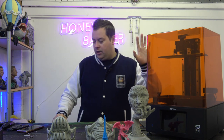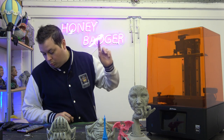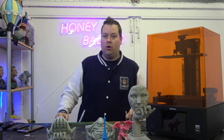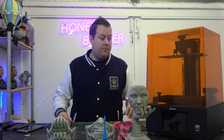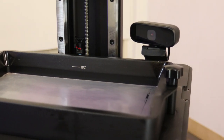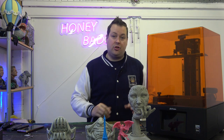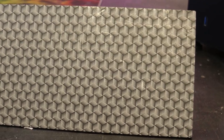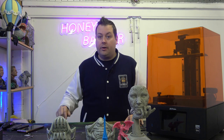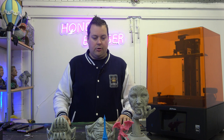The screen gives a print volume of 218 by 123 by 235mm on the Z — a pretty good build volume. The vat takes about 800ml of resin to fill to maximum. The build plate comes factory leveled and has a texture to it, which means you'll be able to lower your initial exposure times on those burn-in layers and not have to worry as much about adhesion.